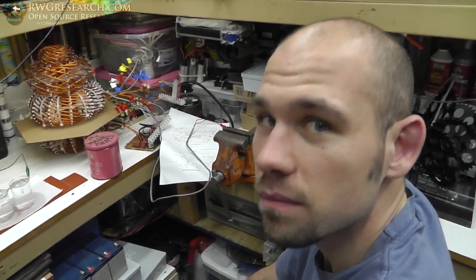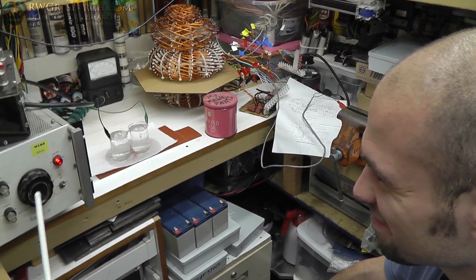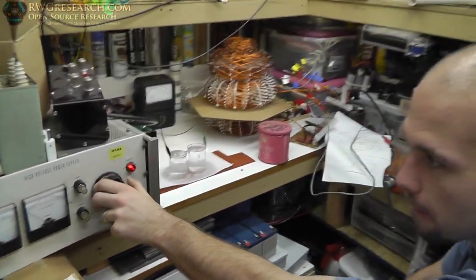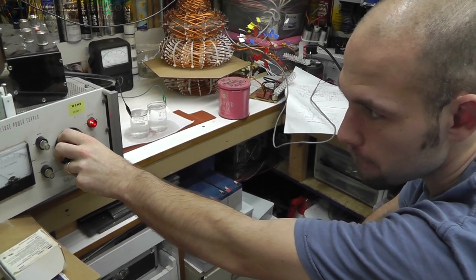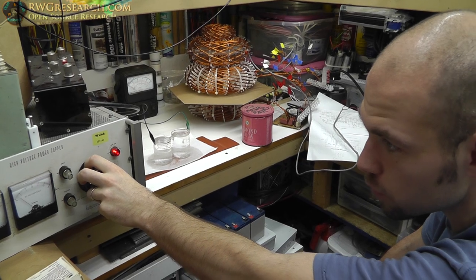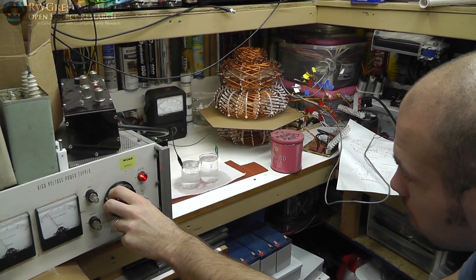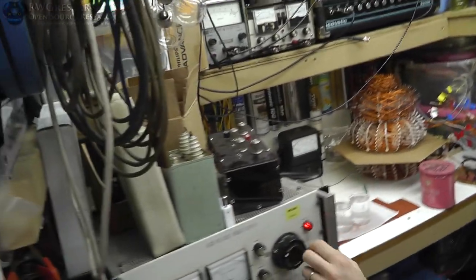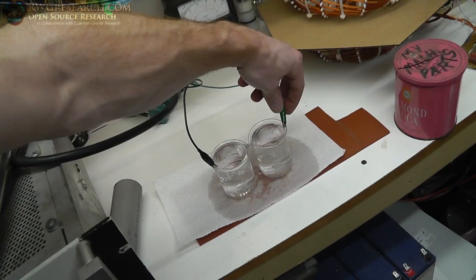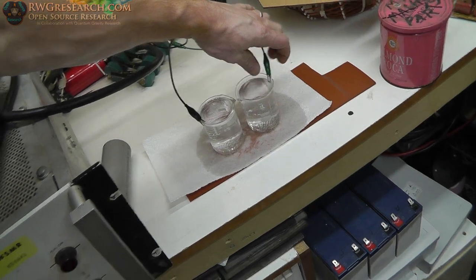Okay, I've quieted the power supply down. My hand hurts now. I slapped it in the face. But anyway, go ahead and turn it up a little and watch the current. Get it to about 1 milliamp. Should we stop at a half or still go to one? Go to one, because I don't think it's formed quite. Oh, the alligator clip. Turn it back off, all the way. The alligator clips are not in the water deep enough.